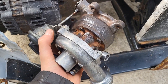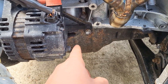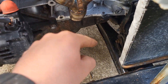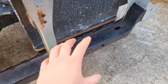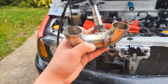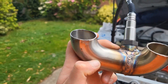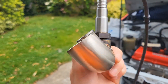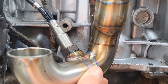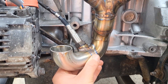Now I'm working on the final few bits for the turbo manifold so I can mount the turbo to it. I'm thinking something like this — I'll only have to add a 180 up into here, the oil drain goes into the sump, the feed comes up from there, the exhaust goes out and down, and the intercooler piping goes somewhere here. A few hours later, here's what I came up with: a 90-degree bend going into three centimeters of straight pipe before going into another 90, and in here I've welded the bung for the wideband O2 sensor. I'm going to weld this piece right on there, then weld the flange out here — and that's the manifold done.